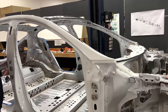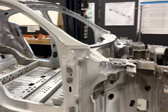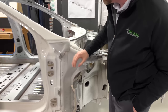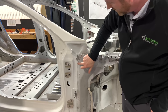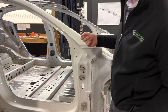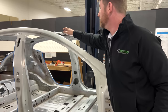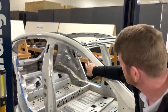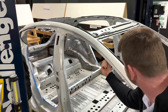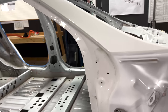As we start to move rearward, we begin to transition — most of this is aluminum as we come through here, though there might be some steel reinforcements inside some of these cavities. You can tell by these concentric spot welds that help get more hits per tool head for cleaning the tool. As we work up the door ring itself, we start to get into steel, so you'll see some self-piercing rivets joining the different materials. The welds here get a little sloppy, though they're probably not a huge structural problem for the vehicle itself.